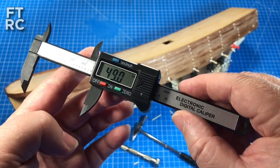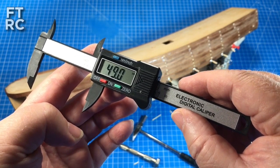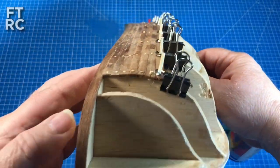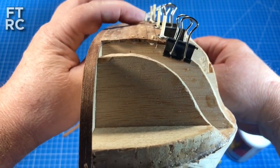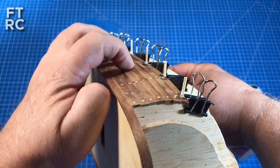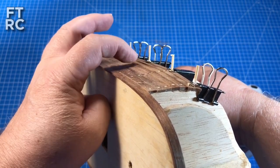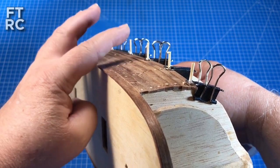And that's not uncommon over 8 to 10 planks to have a millimetre of creepage. Now this occurs sometimes due to camber. We've got a little bit of camber here, not much of a curve, it's pretty flat. At least it was, maybe until our last couple of planks. And you'll notice with our last couple of planks, we're starting to get this clinker effect. Okay, before then they were sitting pretty flush. With the last couple, look, slightly raised on the top edge because they're going across.